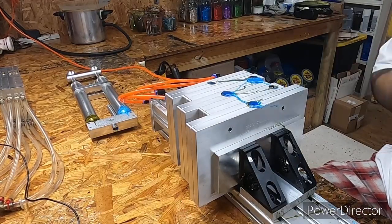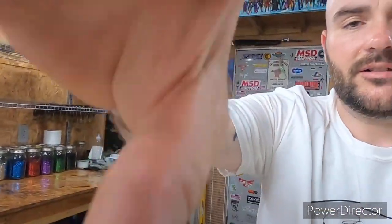Because if you make a bunch of different ones and you're constantly just using the blue to fill it up, then after you shoot a few times, you'll end up with that much blue and that much green, because you're steady using it to fill in. Yeah, I shouldn't have even tried that last one. I knew it looked a little off. Now if I would have had the plastic a little hotter, it might have worked, but it had already started setting up in the injector beforehand.